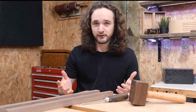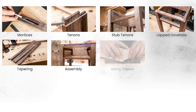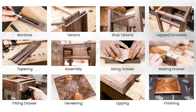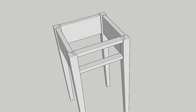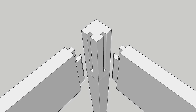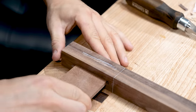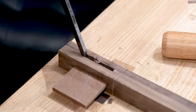If you want to learn more about this process it's all covered in part two of the shaker table series on my free online woodworking school, where each step is broken down in much finer detail — completely free to watch. The back legs include two mortises that meet at the bottom, so while chopping the second mortise I insert a scrap piece of wood to support the inner layers and prevent them from breaking out and loosening the fit of the tenon.